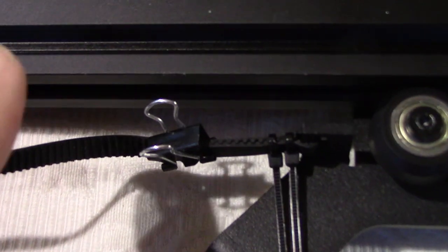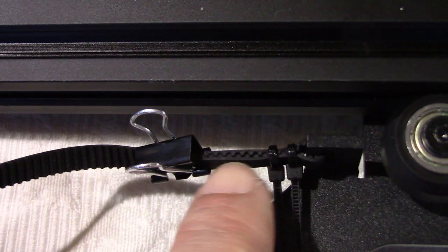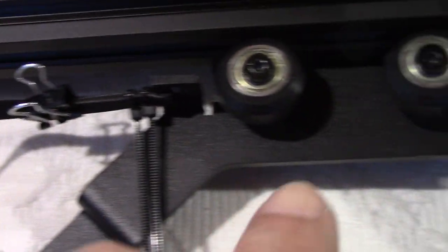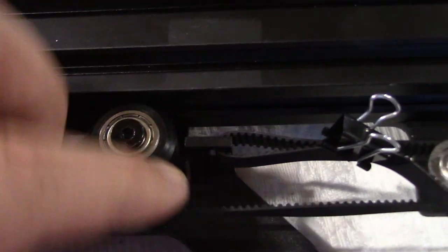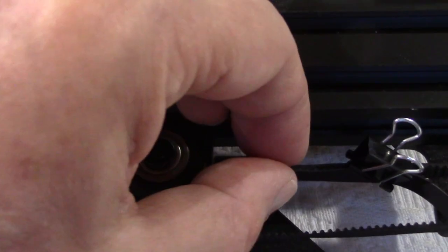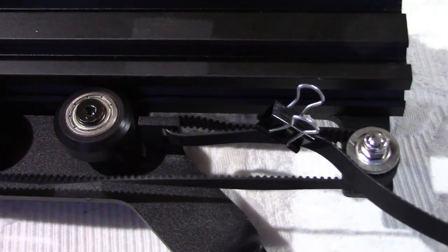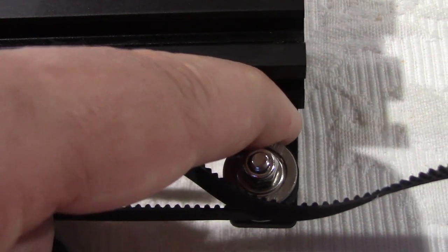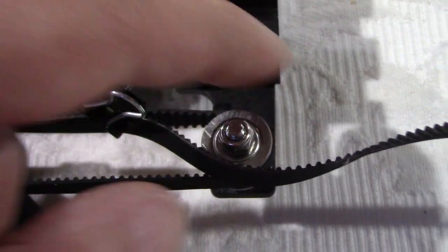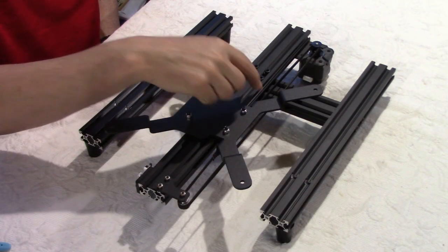The tie wraps are now in place with the clip I was mentioning, and the teeth are in teeth so this is not going to move. I'm going to cut the tie wraps, and before I cut the excess belt I'll make sure I have enough to go all around and connect to the slot. I run the belt from here around the motor, all the way to the idler, and into the slot. I still have one millimeter of play if I need to pull a little bit more. The belt has good tension and I cut the excess belt at both ends — our y-axis is moving perfectly with no wobbling.